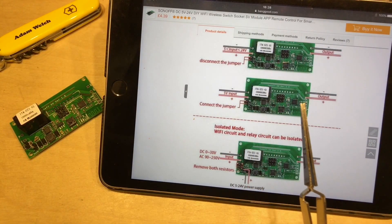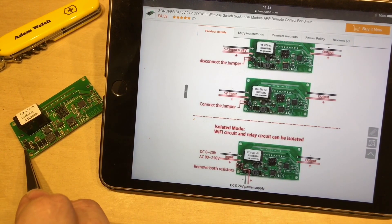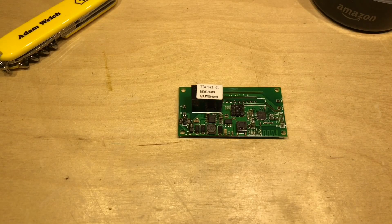According to the image on the Banggood website, the Sonoff SV can be powered by the input being controlled, or it can be powered separately from a completely independent supply of 5 to 24 volts — and if you do that, you're able to switch 0 to 30 volts DC. But to achieve that, you need to remove a couple of resistors next to the jumper and attach another DC-to-DC converter to power the Sonoff's electronics. That's not a suitable solution for me on this occasion, so I'll just leave it on the 12-volt side of the DC-to-DC converter. Now we've worked out where it's going in the circuit, I'll get some terminal blocks soldered on and we'll get it wired in.